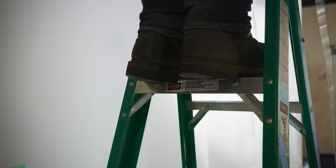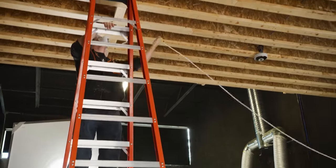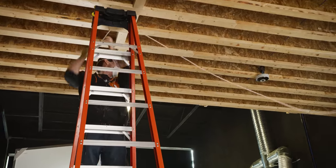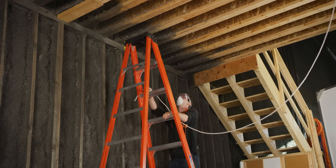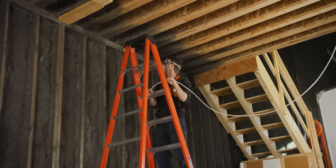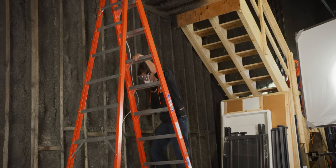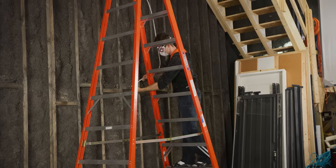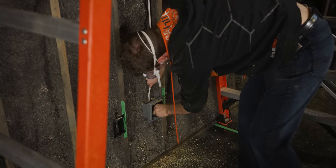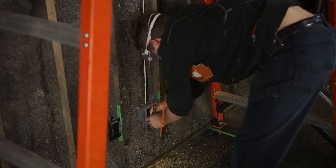I don't think you're supposed to stand on that one. So then I just go over this doodad. Yeah. And pull enough that it doesn't fall. Yeah. As expected, this is truly very tedious. Yeah. I'm having fun so far, though. That's good. I'm electricianing. It's like adulting, but with electricity. And you want to leave a fair bit in the box? Yeah. Like how much? Like that? Yep, that's fine. And now we staple.